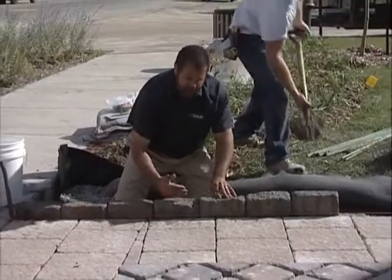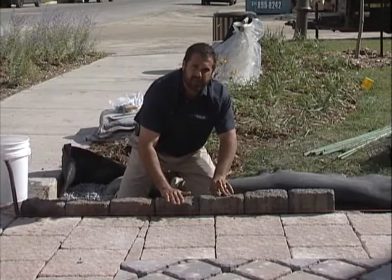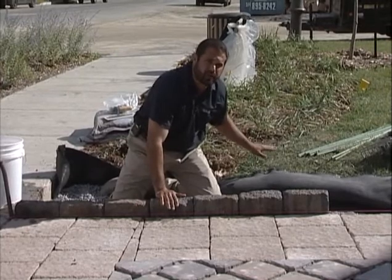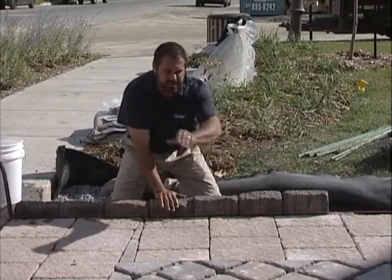These Belgic units elevated above the pavement are also going to help me maintain my erosion and sediment control measures. Any runoff from these vegetated slopes surrounding the pavement will not allow those fines to enter my pavement and clog it.